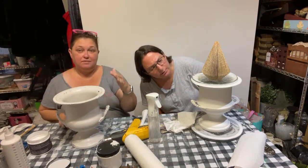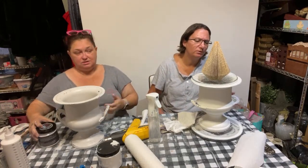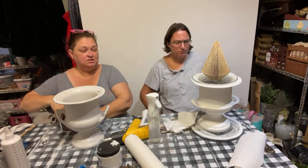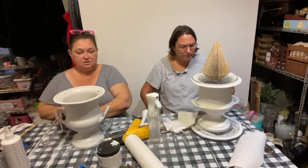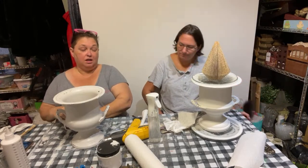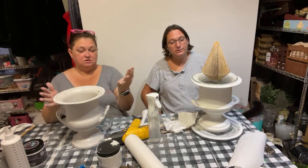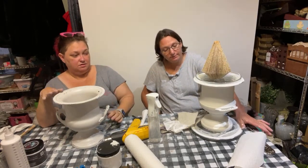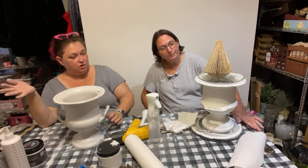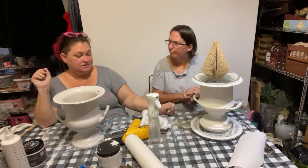And mine using the liquid patina, because you do have to coat it somehow, either with Big Top, liquid patina, or wax. Using the liquid patina, it definitely has more of a glossy look to it. It does give it a little gloss. Whereas this is definitely very flat. And so really, I actually am doing silk on my kitchen cupboards, which someday I'll get done.